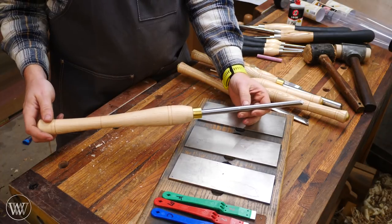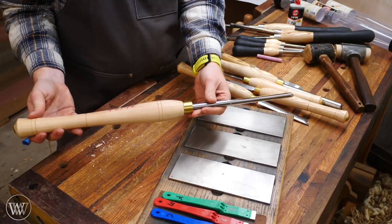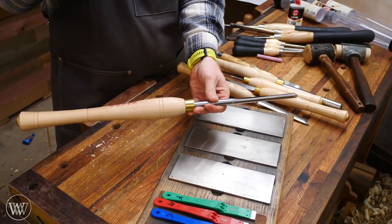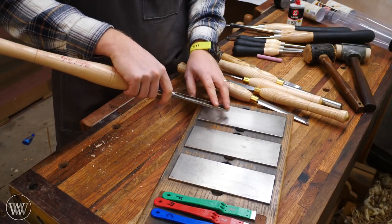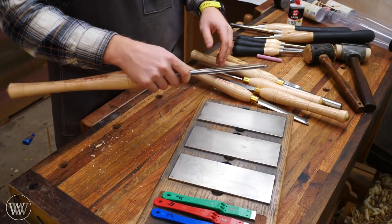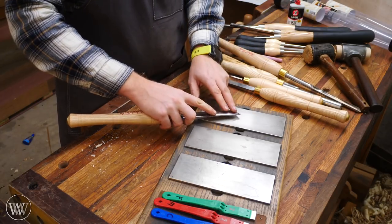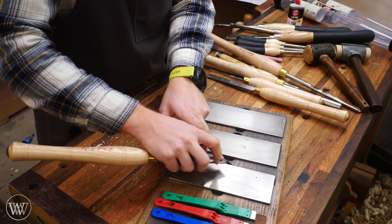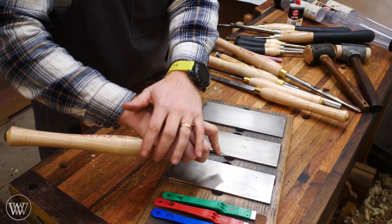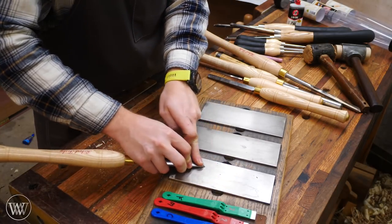The big question you have to ask yourself is: do you need that whole long item? Can you remake this into something that is better for the foot-powered lathe? If you were to cut it off and just turn this into a small handle, then it really isn't that hard to do on these stones. And even with this skew that's about 18 inches long, I could still do this on here and actually still sharpen on the plate. I'm biting up close to it, holding all the weight up here, and just as I'm doing a chisel, I could still sharpen this on here.